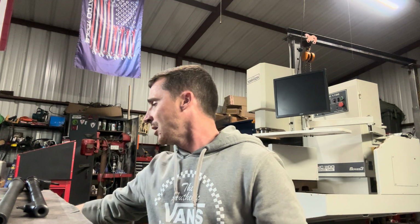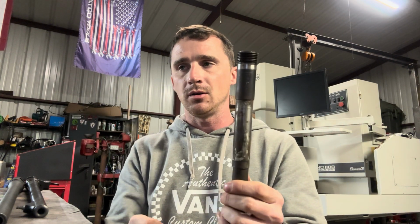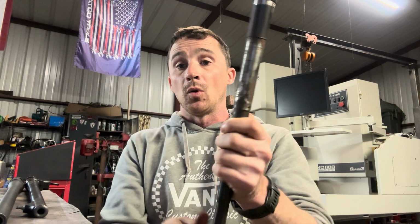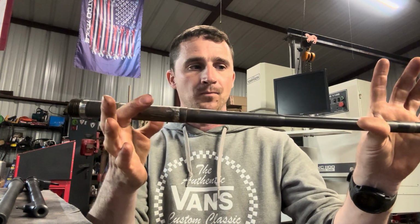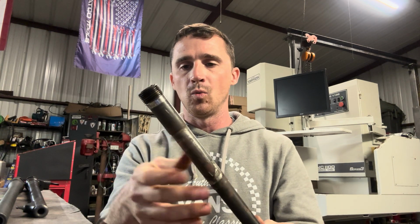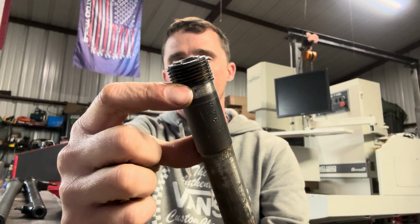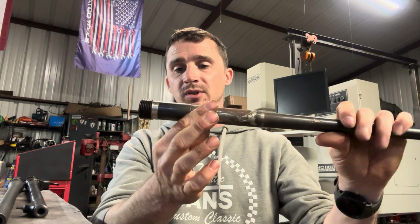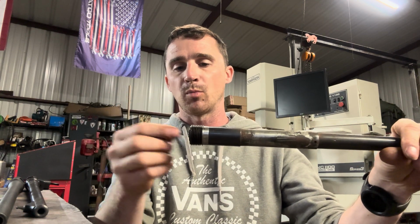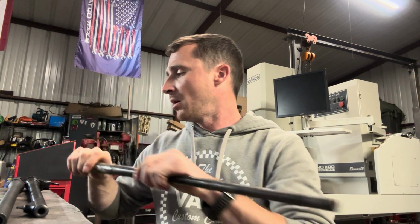Like I said, when looking at a replacement barrel for a rifle, the terminology you want to consider is Mauser barrel. This is off a Yugo Mauser. Came off a customer's gun. It's in trash shape on the inside, and so was removed for a replacement. Your barrel thread diameter and thread pitch here is critical. The style of barrel you're using matters, so this is not a pre-fit barrel. This is a short chambered barrel that would have to be finish reamed for the appropriate headspace and caliber. And then, like I said, a slot cut here for the extractor on your bolt.